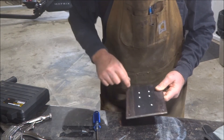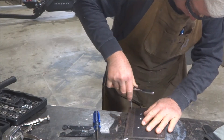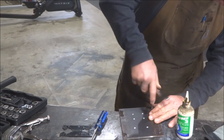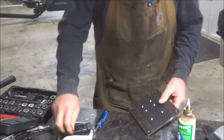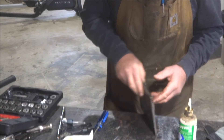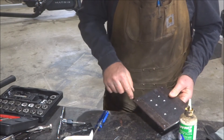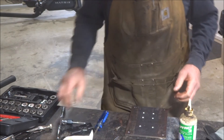Now I'm going to tap these. I drilled them at 13/64 so we'll tap them for a quarter inch. Let's give these a test — perfect. Now we'll take a flat disk and clean this up. I'll profile the edges here a little bit, make them slightly round so it'll fit my router bit when I go to route out a section to put this in.